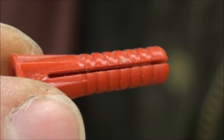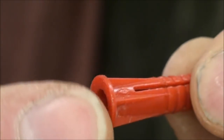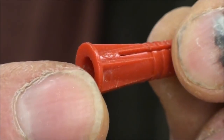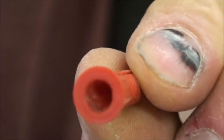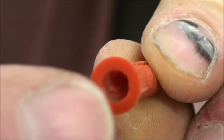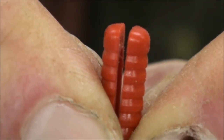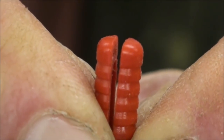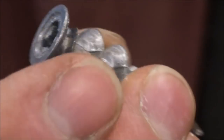This little plastic piece is another type of wall anchor — you can see the slits in the side right there. This is a quarter inch drill bit and it's just the right size for the wall molly itself. You take the drill, drill that into the wall right where you want your molly to be, then you take a hammer and lightly tap this into the drywall to where the head of this is flush with the drywall. Then you take your screw and screw it inside the plastic opening — what the screw does when it goes in will expand and stretch this out and hold it tight inside the hole you drilled in the sheetrock. These are going to be more than adequate to support this little shelf. This molly here is stronger than the plastic one I showed you.